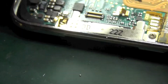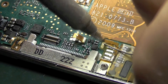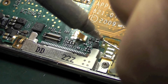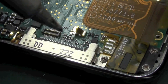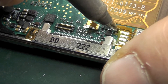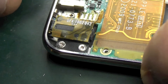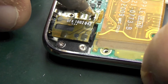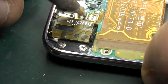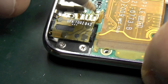Last one — this one we have to take a bit more care of because of the amount of components there. Now what I'm going to do, because I've only got the solder on there for now, I'm going to apply a little bit of pressure and heat to each of these to make sure we have contact. Not for long — if you can see the amount of time I'm staying on each of these connectors, it's not for long. You don't need to, because obviously good heat conductivity is taking place between all of this down to the board.